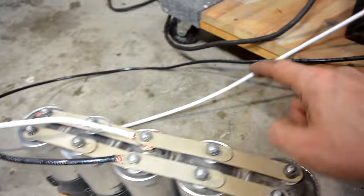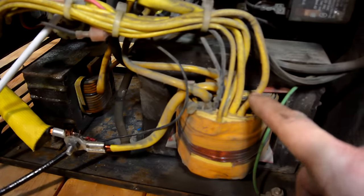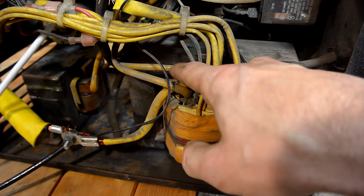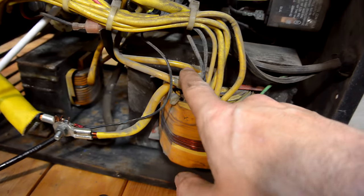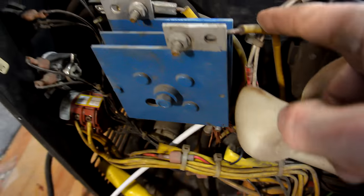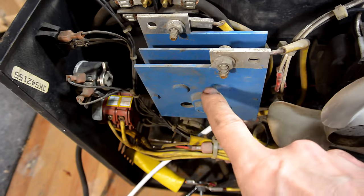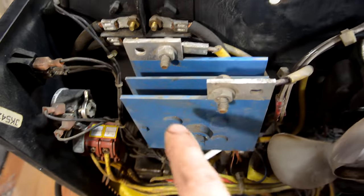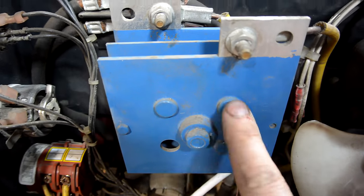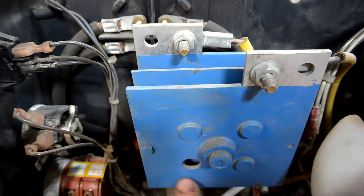I've added an extra lead to my capacitor bank. The other side of the output winding is these two here — there's one, and here's one — and these go up to here. This is a half-bridge rectifier. It looks like selenium rectifier plates, but there are actually three silicon diodes in here, and these big plates are just a heat sink.